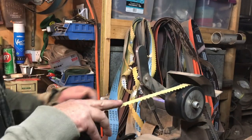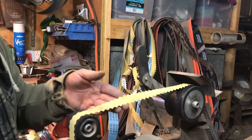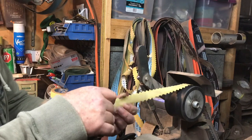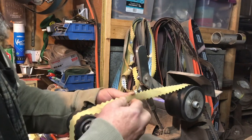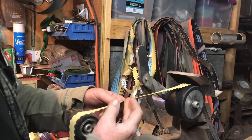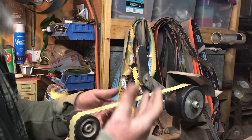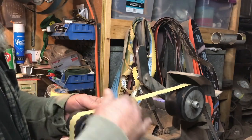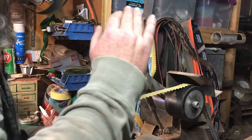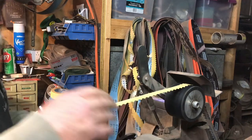All right, here we are. These are the handle belts that I use. This one is a scallop belt. It's only 1 inch wide, whereas normally I use 2 inch wide. It's scalloped on the edge, so it's softer on the edges, so I can move along a flat plane a lot better without leaving gouge marks on it. This one's at 120, we'll then go to a 220 and a 240.